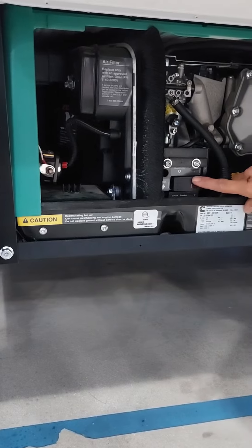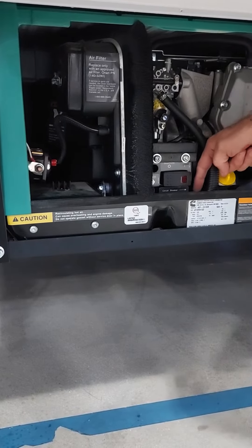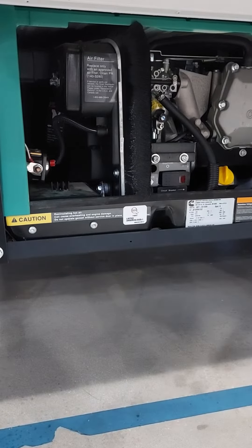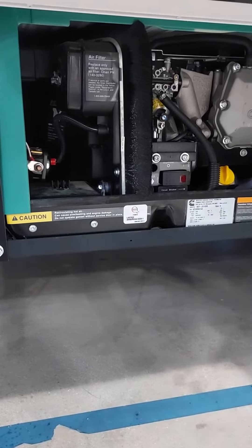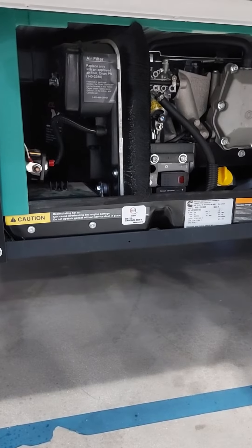After that it's every 150 hours. I've got that written down for you. The service switch is right here so it can be started outside. Straight down where my finger is pointed, there's a breaker — it trips front to back. It actually goes like this: front, back. It should always be pulled out this way — it'll allow the generator to run.